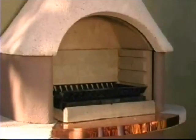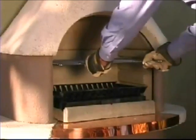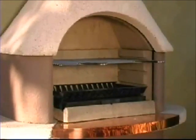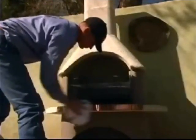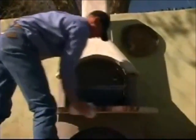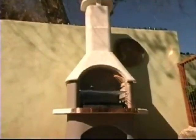The finishing touches include the grate, grill, and ash box. Your fireplace grill will be ready to use in about 6 hours. The mortar is going to require 24 hours to fully cure and set. Take care not to overburn the unit with the use of high-burning coal, wood pellets, or other non-approved fuels. It is rated for 1300 degrees Fahrenheit.